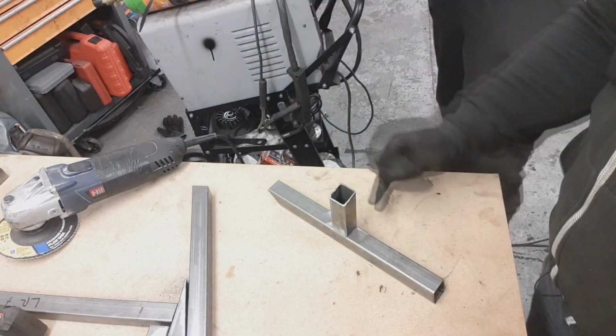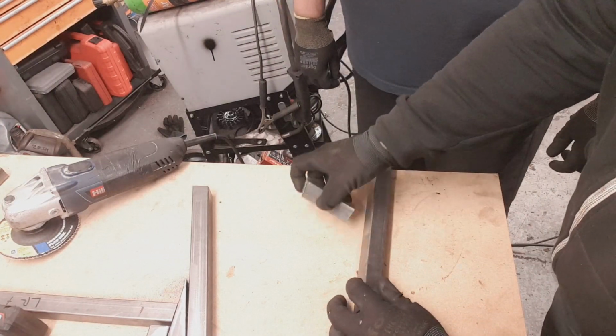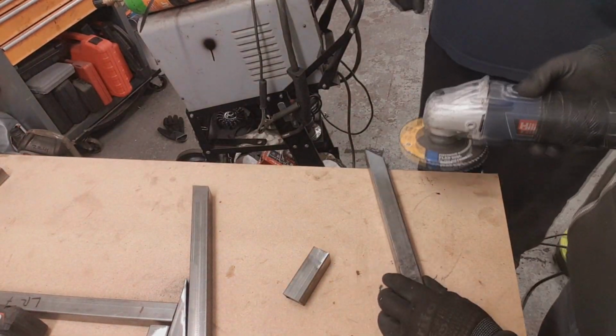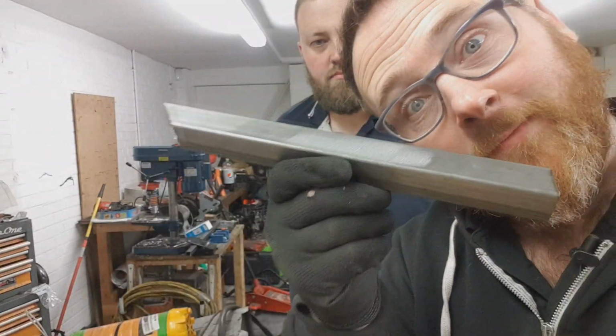We're going to weld here, and we're going to weld here. If you are going to go all to town on that, you need to prep this part as well, because you're going to run a seam weld along there. But for the purposes of this, let's just do it. Let's weld sideways one. There you go, spot the difference. Look shiny, actually shiny. That is what you need.